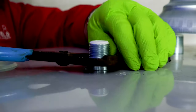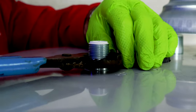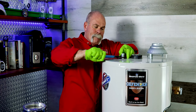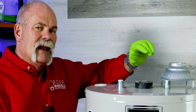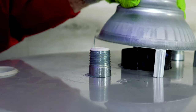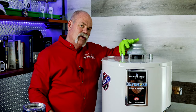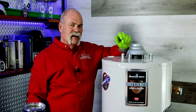Now I'm keeping my channel locks down on the part where I'm not interfering with the threads, because I don't want to mess the threads up when I go to make my water connection. And I want to make sure that I get this good and snug, because I don't want there to be any leaks on the threaded connection down below. Now, all we've got to do is put it all back together. So at this point, whatever you had to undo on the Bradford White to get the water connection apart so you could take that out, you want to put that together now.